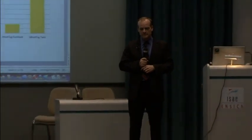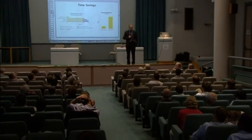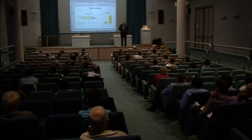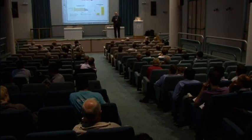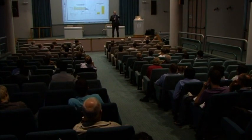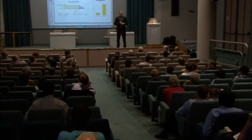So there will be no impact on engine bleed to start the engine? No. It depends on the APU, but the APUs for both of these aircraft types are rated for full bleed and full electrical load simultaneously. And by way of comparison, APU wear comes mostly from bleed. It's not really very much from electrical. If you go from 0% to 100% electrical load on an APU, your droop is only 1%. It's a very small load by comparison.